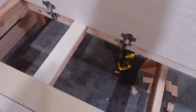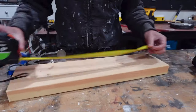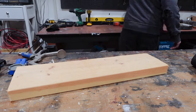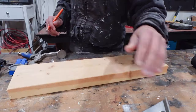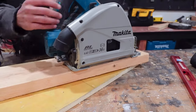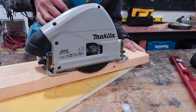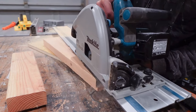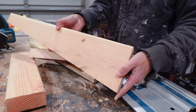After the bench top was mounted, it was time to work on the backrest. I wanted the back to be angled for comfort when leaning back, so I'm using two-by-six for the support pieces. I'm eyeballing a reasonable angle that will be comfortable, maximizing the space between the seat and the wall. I marked out an angle that looked good, cut it out with my track saw, and then used that piece as a template for six or seven other back support pieces.